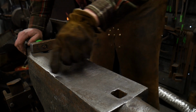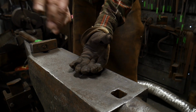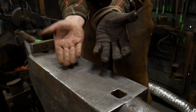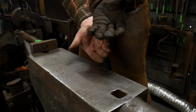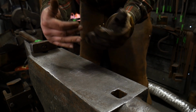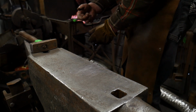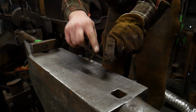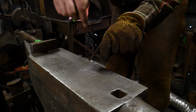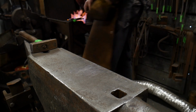Now I've found when we're doing this, you want to make a really nice smooth arc on a bend. You don't want to have any sharps, like bending the tip fairly sharp and then bending a little sharper somewhere else, because that'll end up kinking the piece and it'll put pressure. You'll see what I'm talking about here in a second. If you bend a nice smooth hoop, you can tighten up that hoop once you're pushing the material through. You'll see how that works here in a moment.